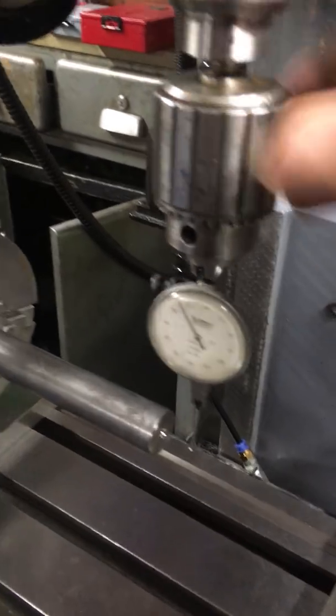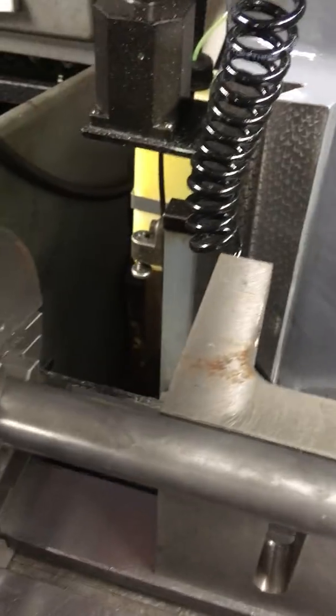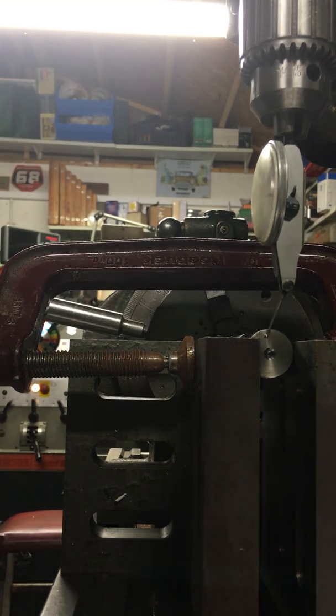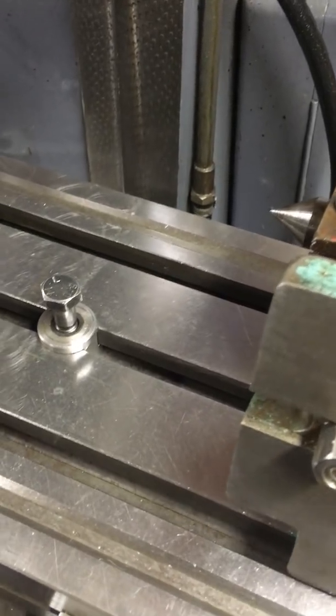All it relies on is a dial indicator. In this case, because we haven't got a fixed jaw or a loose jaw, I'm going to place an angle plate on this side and a clamp across the job. The dividing head has been fitted with dogs - these hexagon pieces in the bottom - which fit into the T-slot, aligning the job true to the axis, in this case the x-axis.